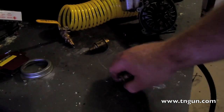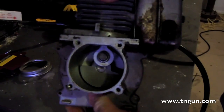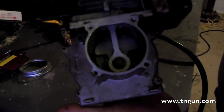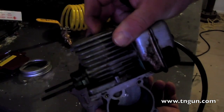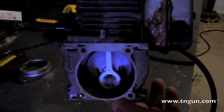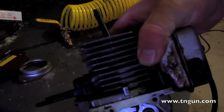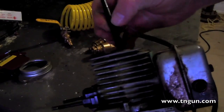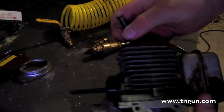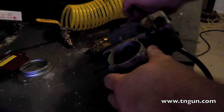I had to measure because of the way the thing works. In a two-cycle engine, the piston comes all the way up, which gives some compression. When the spark plug fires, it's an explosion and pushes the piston down. Well, if we put this push rod in here — see how it moves — when it's all the way up at the top it sticks out pretty far, but as it pushes down it doesn't stick out so far.